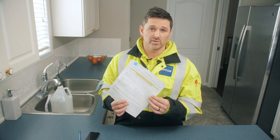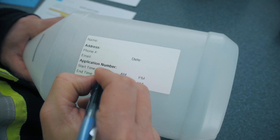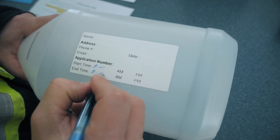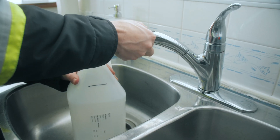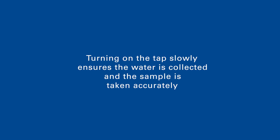Place your jug underneath the tap as a reminder for the 30-minute stagnation period and not to use water. Once your timer has reached 30 minutes, write down the stagnation end time on your water sampling form and again on the label located on your bottle. For example, this morning we started at 8 a.m. and will be finishing at 8:30 a.m. Now it's time to collect the sample. Grab your sample jug and place it below the tap if it's not already there. Remove the cap and remember to turn on the water slowly in order to fill the jug to the indicator line. It's important to capture all of the water.